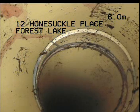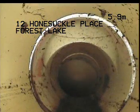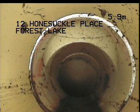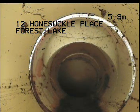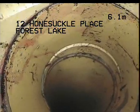Okay, so I just needed to remove a very large trampoline for access. I just wanted to get my bearings as to where I'm at. This inspection pipe here is actually 5 metres to the left of the right-hand boundary, and it's about 2 metres from the rear boundary fence. So that's basically the boundary. That would be a boundary inspection pipe. I don't know if it comes to surface. I don't see any glue coming down, so it may just be an inspection pipe rather than an actual inspection opening to surface, although there are lots of pavers here that may be covering it.